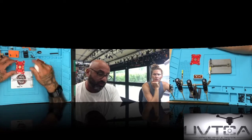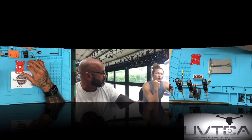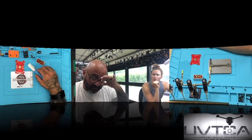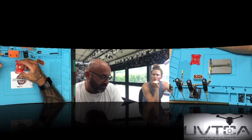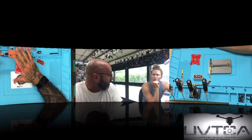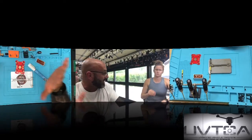Okay? Because then you're also gonna tin your wire. So a little bit of solder there, a little bit of solder there. And when you bring it together, it heats enough. Right, because what you'll find, and a lot of people deal with this, is if you're soldering and you don't pre-tin your wire, even though the soldering iron is super hot, it needs the solder to pass the heat through.